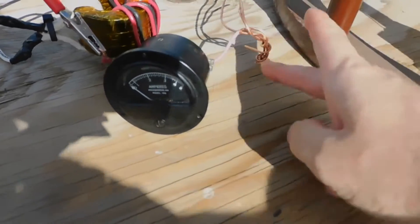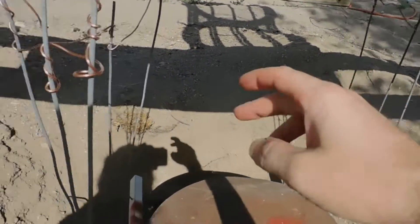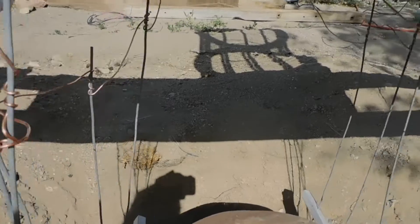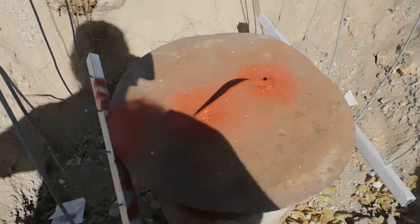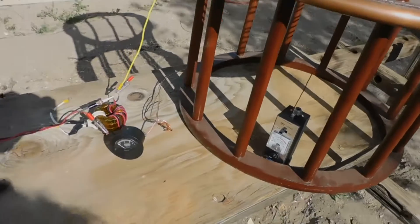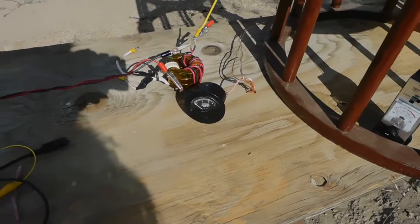That's running through this bundle of copper wire, which is going beneath the bench here, getting branched out to ten separate ground leads that lead into a very large high-capacity tank sitting beneath the shop. The measured impedance for this system is supposedly around one ohm, so as long as we get a good connection to that, that would be good.